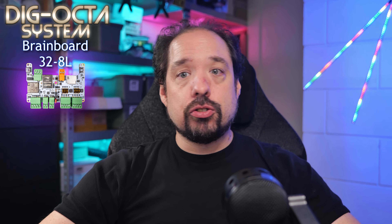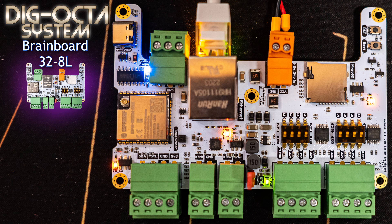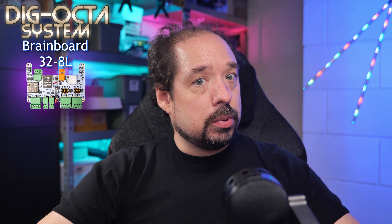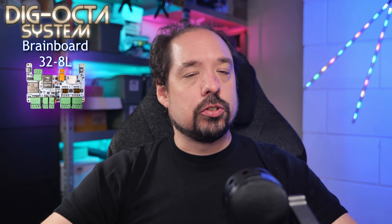Other neat features include several diagnostic LEDs. The green LED lights up when 5.12 volts is being made by the onboard DC circuit. There are three orange LEDs in their respective areas showing that specific area is receiving 3.3 volt. And lastly, a blue LED indicates whether the relay is activated or not.